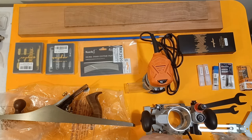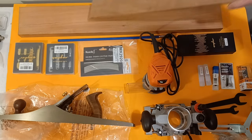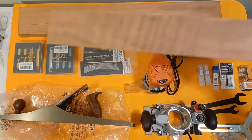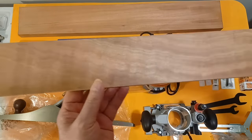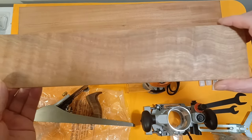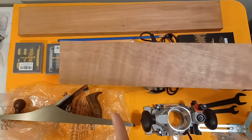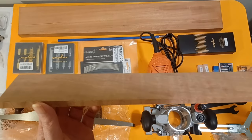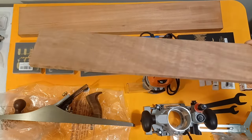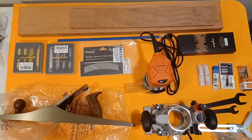From there, I got the wood for the neck and the fretboard. The wood is African mahogany and this is sapele. I did a little bit of sanding on it to smooth it up so I can better show the chatoyance and the grain patterns. One thing I'm thinking about doing — since it is kind of weird and as a player looking down on the neck it kind of throws you off — is going the ebonizing route with the steel wool and the vinegar, blacking that out once it's radiused and the frets are cut into it.